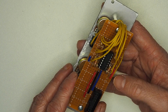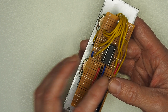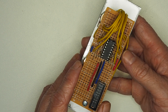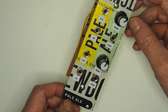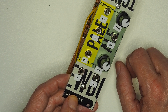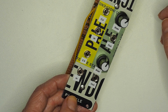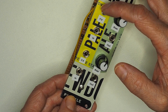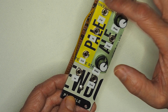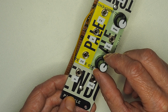Because of that, it is quite a simple circuit — just one IC and a few discrete components to control the levels. In terms of how it functions, it's incredibly simple: you pass an audio signal in and you get an audio signal out, and the volume level is attenuated by the control voltage input. If there's zero volts control voltage, the output will be zero; if there's a 10 volt CV input, the output will be as loud as the input signal.